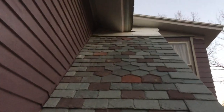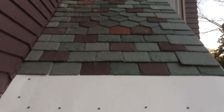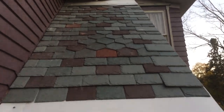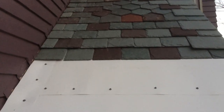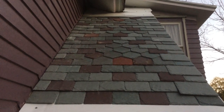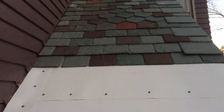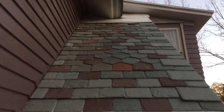I want to do a quick recap of this roof. Partway up, after I got past the aluminum, I did switch to the copper nails — they drove in better and are definitely a tougher nail. That made me think I should also mention: when you put on your roof boards, one-inch hemlock is what I would recommend. Nothing thinner and nothing weaker. You want solid wood that you can nail into, because that way it doesn't vibrate as much and your slate doesn't bounce around.